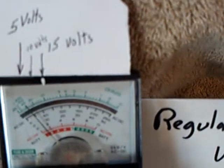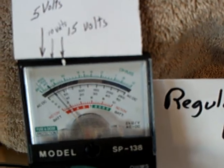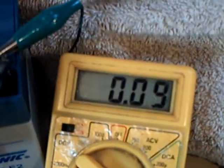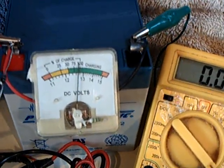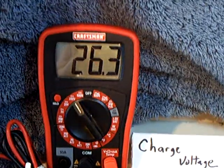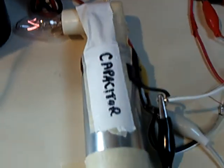I've got this dialed down to about 5 volts and we're drawing less than 100 milliamps. There's your source battery voltage, and this is the standing voltage on the capacitor right here at 5 volts. You can see the light is glowing right there — that's a loaded capacitor.